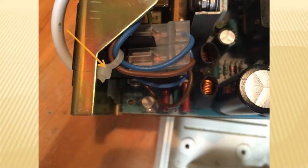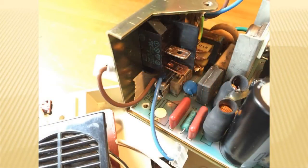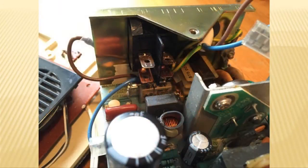Next, cut the tie wrap and remove the four connectors. Now these are really, really stiff. Note also that the brown connectors are on the outside and the blue are on the inside, but make sure you make a note of which one goes in the upper and lower sockets — you might actually want to label those. Here's a picture with the four sockets unplugged, and again from another angle. It's actually quite easy to work out which of the brown and blue wires goes on which side due to their position on the board.